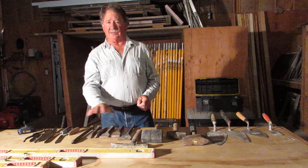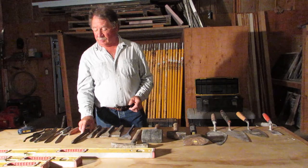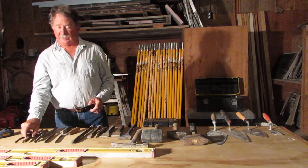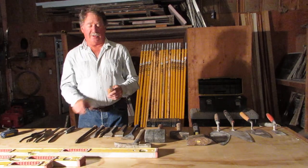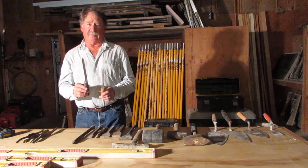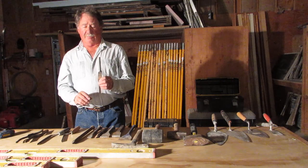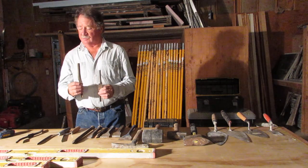Again there are many chisels around — these are the ones I had in my tool bag and they seem to work well. The next sort of hand tools are tools used for dressing the joint: after the stone is mortared into place, you need to tool the joint and dress it. There are tuck pointers of different thicknesses, used primarily for brick work and also for block work and some stone work. There are also tools called joiners, used for brick work and block work, which tool the joint to a convex or concave surface depending on which one you use.